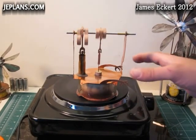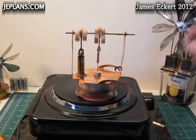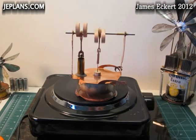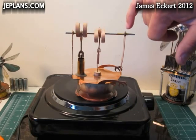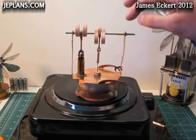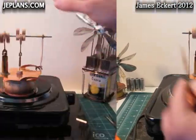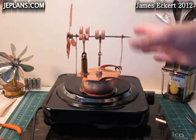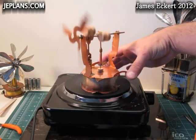With the bearings added, we've got it running without any flywheel on right now. A lot of engines won't do that — running without any kind of fan or flywheel to carry the momentum. The main thing we're trying to address with the bearings in the uprights is that there was a lot of friction; if you don't have these perfectly square, it kind of pinches against the metal. This is the unit running with the fan — the design fan.